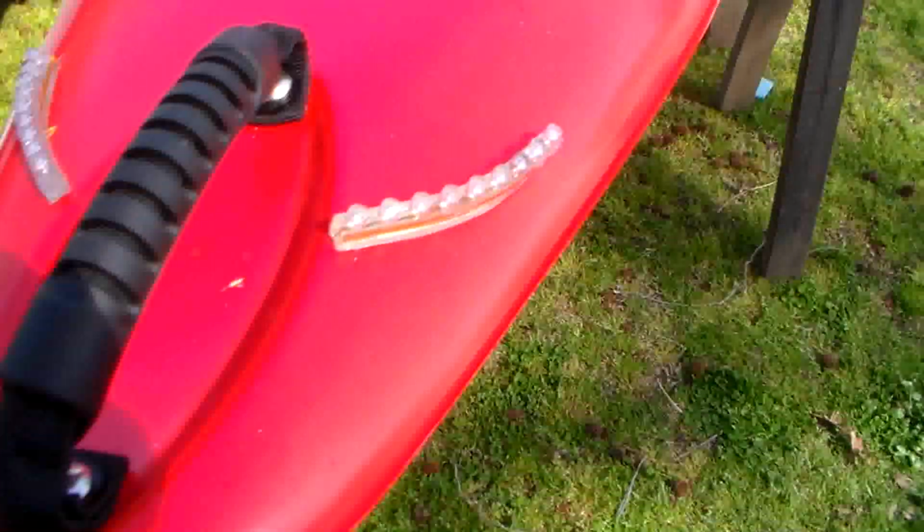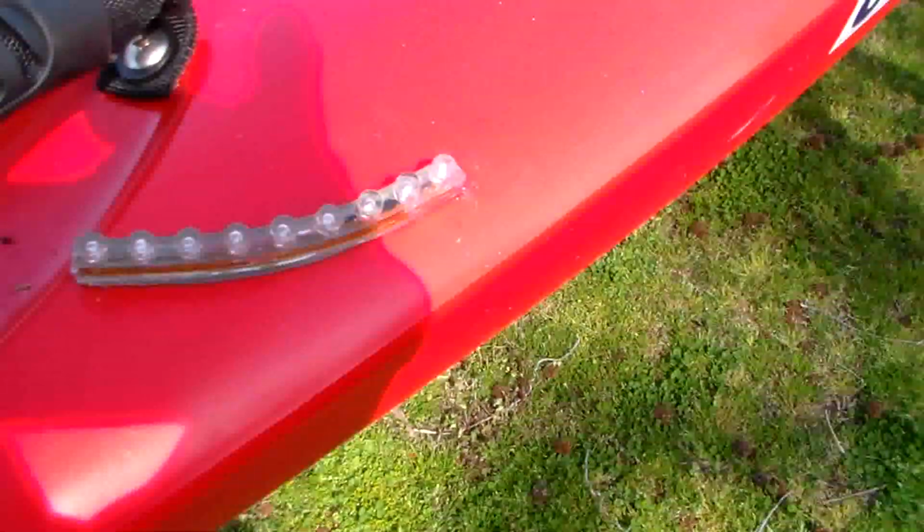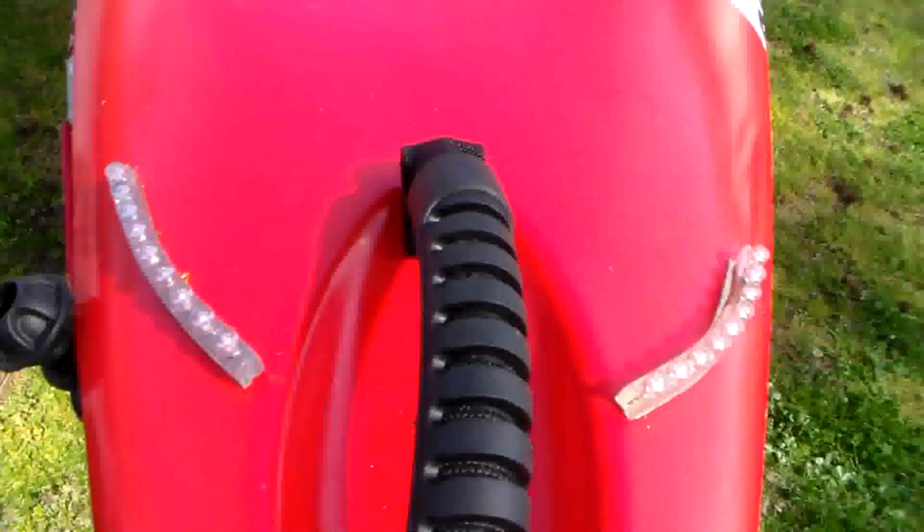Got some navigation lights here on the front. Got these off Amazon. I'll put a link to these in the description. Got the red one here and the green on the other side. There you go. All I did is just drilled a little hole right there, fed the wires down through, put a little marine goop on it.